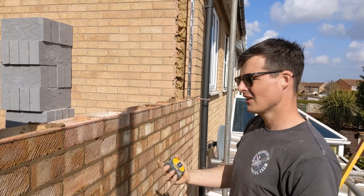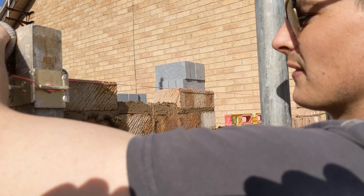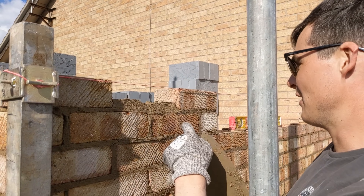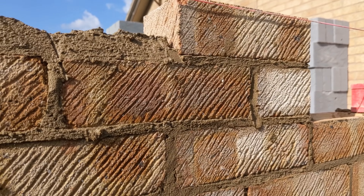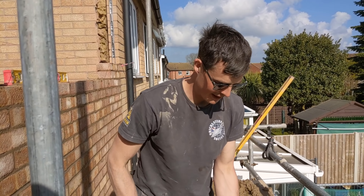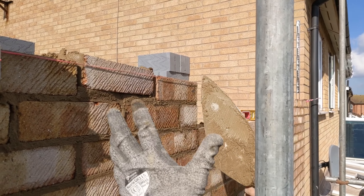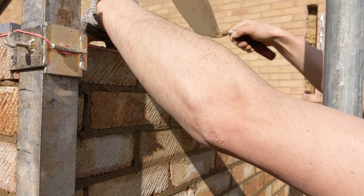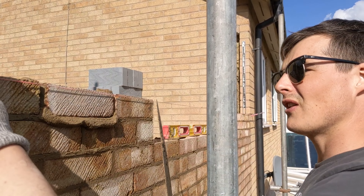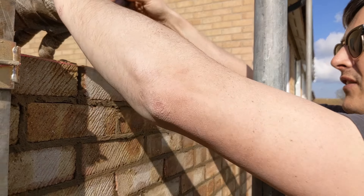Something you really need to pay attention to when doing little pillars like this is having even joints. You've got your distance to work with — 660mm — you don't want a razor-thin perp, you don't want a dead tight perp there and then a massive one over there. So you even your joints out, because there's nothing worse than when you look at a pillar and you've got a couple of big joints and then right on the end you've got a dead small one. Good practice is to lay the two end bricks first because it's so small, then put the final one in the middle and make sure your perps are pretty even. This is something my old boss — Dad, if you're watching — used to pull me on all the time. I used to have dead tight joints all the way and then a massive whammer slammer right at the end.